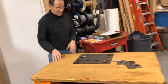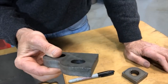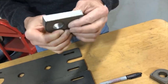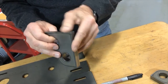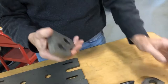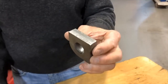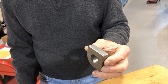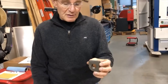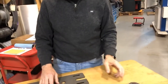Here we have just a few parts — a super clean cut on 5/8 inch material. Some of it is blasted to remove the oxide, which works very well, and that's what you should be doing. We still have some oxide here; we can try to brush that later, but brushing works best on thicker areas. For a small part like this, oxide removal other than blasting would be vibratory finishing.